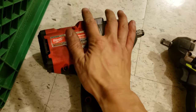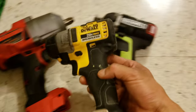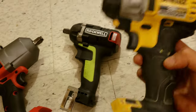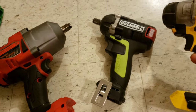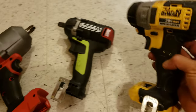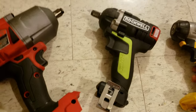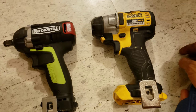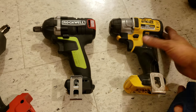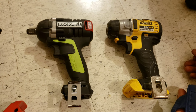Of course, that's what it's meant for. It's huge, right? Heavier duty. But a tiny little guy like this could almost do a job a big guy like this could do. Well, that's a stretch though. You could force it. So if you've got one or two that you need to do, you don't have to run home to get that. You could use a small little impact driver to tighten down a lag screw. And that's an 8-inch, man. That's long. Just have to pre-drill the hole, huh? Otherwise the wood is gonna split like candy. Does candy split? What else splits? Oh well, anyway.